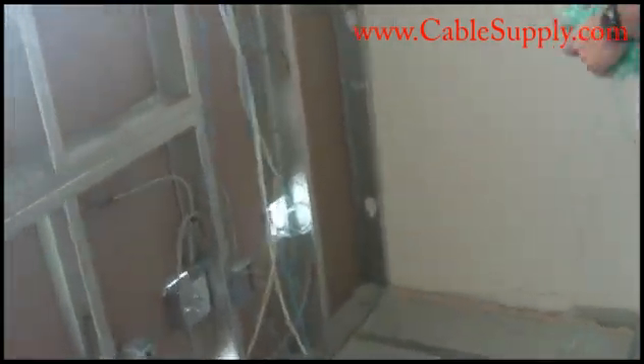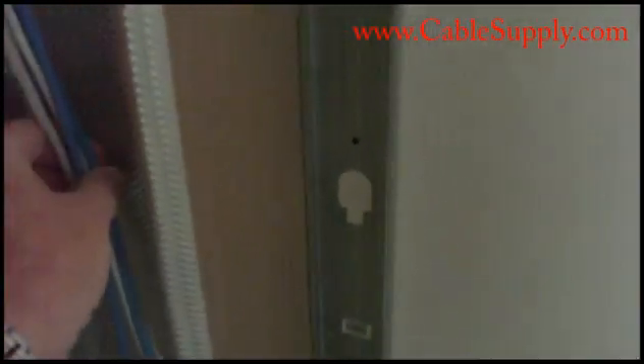The reason why it's not ideal is because the cable — and I'll show you here — has to be attached somehow to the metal I-beams. There's a possibility that if the cable comes a little loose and ends up on the I-beam, when they come with the drywall on top, they can pinch that cable. Drywallers aren't going to be looking for your cable, so this adds extra steps.